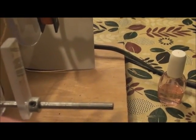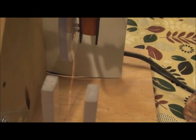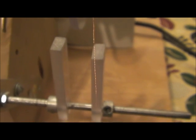When I gingerly sand the wire, when I coat it again, I just use some clear nail polish there. You can sort of see the beading of it there. Then I know it's insulated again and I can carry on. Well, next time you see me, we should have these all ready to go and ready for potting.